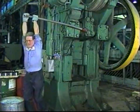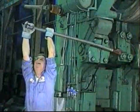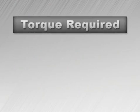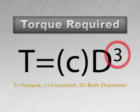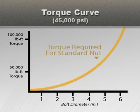The main problem is that for bolt diameters over one inch, it becomes very difficult to create enough torque to tighten or loosen the bolt. Simple physics shows that the torque needed to properly pre-stress a bolt increases by the third power of the bolt diameter. Therefore, as the bolt diameter increases, the torque requirement for tightening soars.